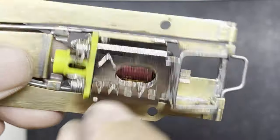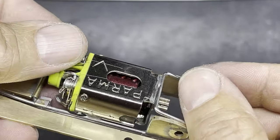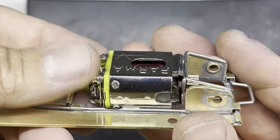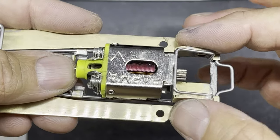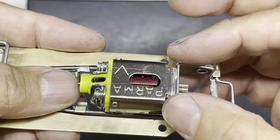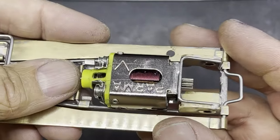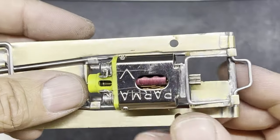If I'm soldering the motor on the two sides like this and the top, then that sort of triangulates the whole thing. The cans on these are pretty strong, so they're going to add some strength to the chassis anyway and the back end. These pillar blocks can't push in because of this bracing over the top here. So even if it gets a sideways knock, that bracing will protect it, especially when I solder it all the way along. So I think the back end's going to be pretty strong anyway and shouldn't need any more bracing.